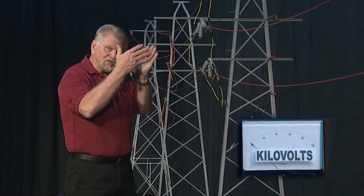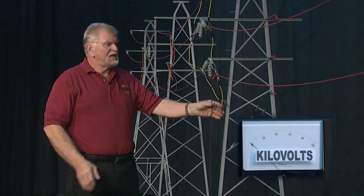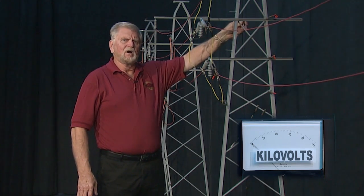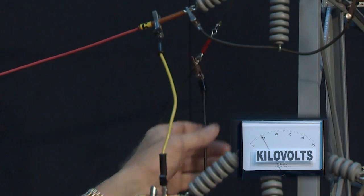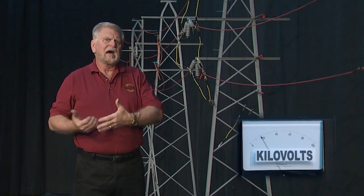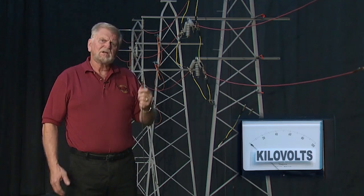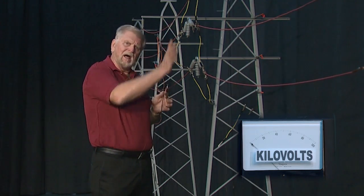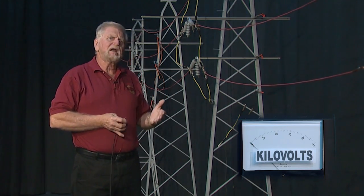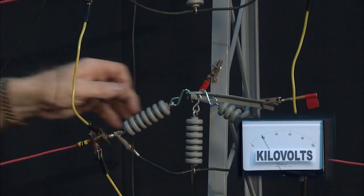Nothing will be changed out on this structure. The grounds are positioned exactly the same way as they were. I leave the lead representing the worker's hand on the conductor where it was. I will then use the lead representing the worker's feet and contact the grounded portion of the metallic guy wire. As you can see, if the worker was to bump from the conductor to the grounded portion of the guy wire, there is a hazardous difference of potential between the grounded conductor and the guy wire. This would be lethal to a worker. I can remove the lead representing the worker's hands from the conductor because with the theory of equipotential grounding, once the grounds are applied, everything within this zone — the conductors, the structure — they're all at approximately the same voltage potential. So it doesn't matter whether the worker is bridging from a conductor to the guy wire or the worker stands on the tower and bridges to this guy wire. The same hazard exists.